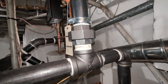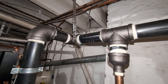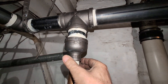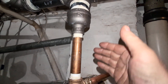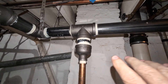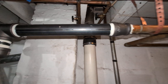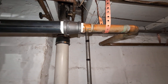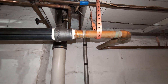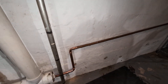This presented some issues. The first take-off is the long main, and you'll notice we've got a drip here. We've got a regular two inch T and a two by three-quarter inch — essentially a funnel catching the condensate which is rolling back. This is a counter-flow main, meaning the condensate and the steam are moving in opposite directions. Then we come to the copper — that's inch and a half copper — and there's a drip here.